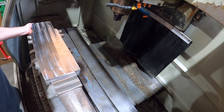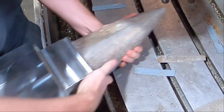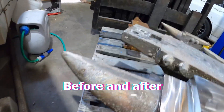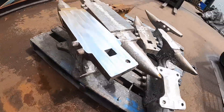It doesn't matter which end comes out first — horn first out of the machine from now on. And that's it finished, finish machined anyway. There's still a few other processes we do to our anvils. The reason we've machined the bed is to give a perfectly flat finish for the blacksmiths. A lot of anvils aren't flat on top, but we know how ours is. We'll also buff the machine marks out. That was a pretty close shave there for Dian — he nearly broke a finger.